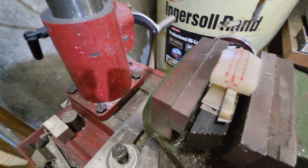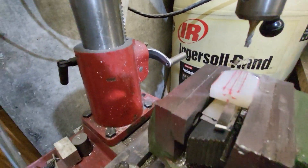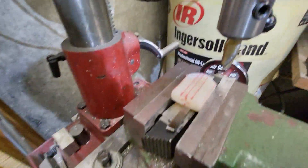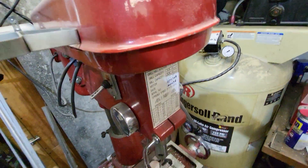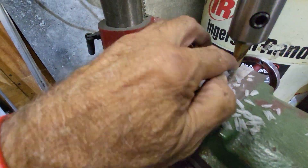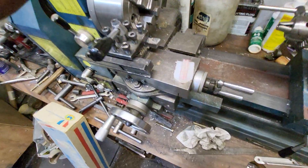They were all set up in there to mill that flat spot to thin it out. I'm not going to change — maybe I should, because I could do it in one swipe if I put a bigger bit in there. That took me a little longer, and I thought somebody didn't put the 7/16 wrench back up there — can't trust me. Anyways, I found it and got her changed, so we'll do some milling. There's one side. Sure mills easier than it saws — it was a pain using the bandsaw on it.